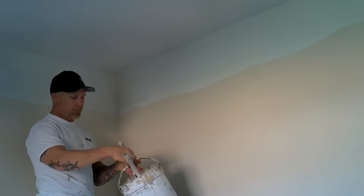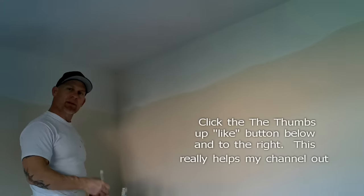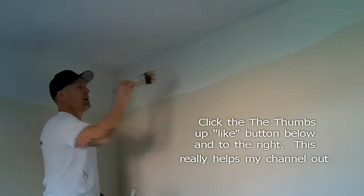I'm working on this ceiling cut. I'm going to start the ceiling cut-in from the corner over here. I've got my brush, just going to be dipping my brush into my bucket of paint, and I actually like to just tap my brush on the side of the bucket to make sure it's not going to drip. So I'm going to dip it in my paint, tap it on the side, and then while I'm holding my brush, if you turn your brush it won't ever drip. But if you hold your brush flat, eventually the paint's going to sag and begin to drip. When I'm moving it to wherever I'm going, I'm actually going to be twisting my brush in a twisting motion.